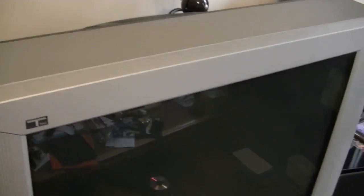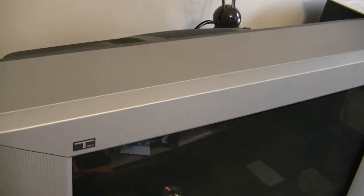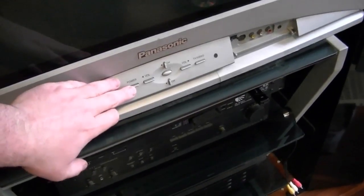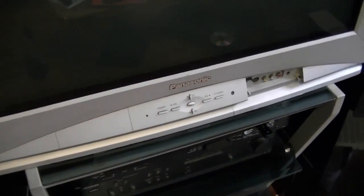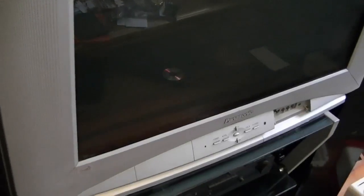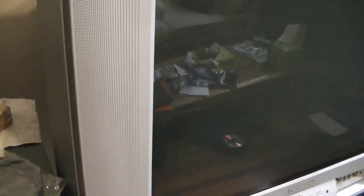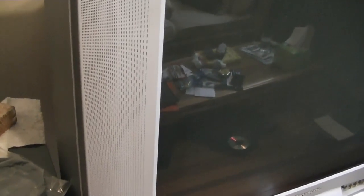When I got home, I wanted to flop on the couch and unwind a little bit with some TV. Unfortunately, when I went to flip on the Panasonic Tau, I got a click and then nothing, and now I just get nothing. Now that click is normal, that would be when it kicks in the degaussing coil before powering up.